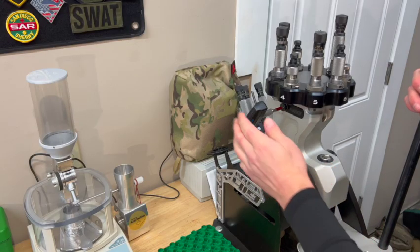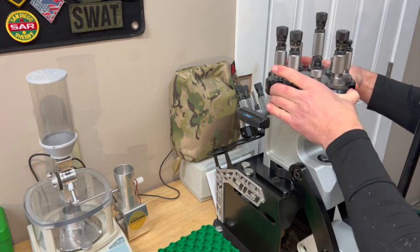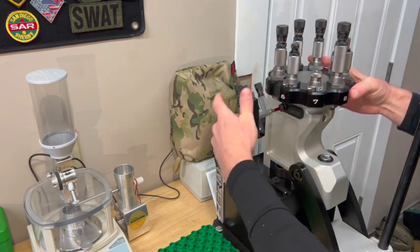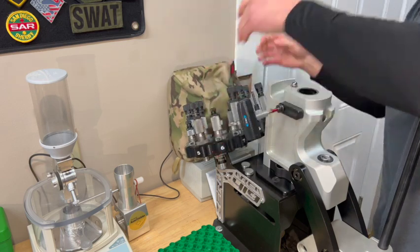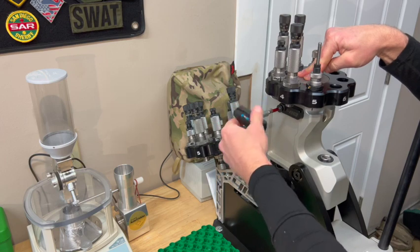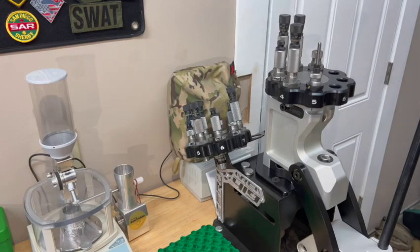When we were doing the sizing process, I mentioned there's a bolt on the side of the Area 419 press that locks the turret into place. Area 419 gives you a little preset torque wrench — you loosen that up to rotate, and there's a detent on the head that stops at each position. For this next operation, we have to remove this head and put the spare head in. Simply loosen it up, the head comes out, then we push the new head down, run the clamp down, hit the torque wrench until it pops, and we're set.